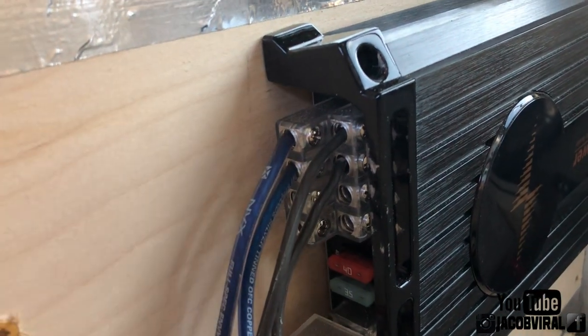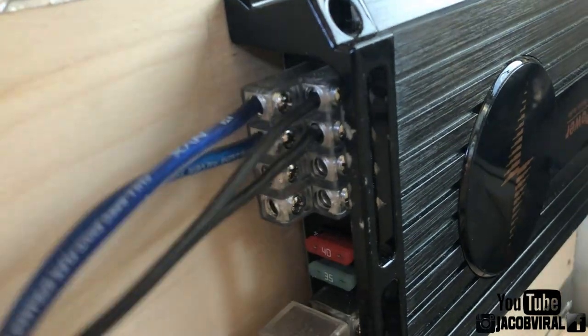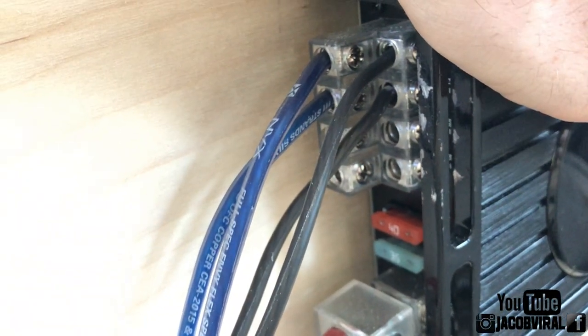If I only had enough speakers or tweeters to run on two channels but not four, it's perfectly fine. It's just going to use certain components of the amplifier, not all of it. So you might notice certain parts of your amplifier get hotter than others, because that's where your current draw is coming from — and that's what I noticed with this.